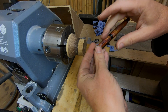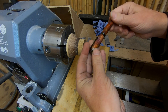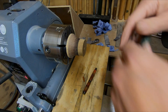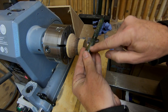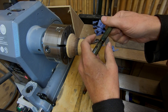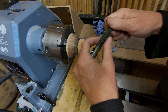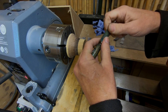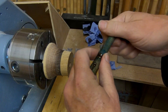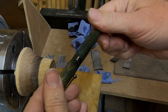Sometimes with these, the thread starts off in two different locations. So if you find your grain isn't lined up — and it's harder on this one — I'll show on the other pen I made where it's a lot more obvious. You can see: if you unwind this and let it click once, push the pen together gently — it's clicked once. If I wind it up again that grain is no longer lined up. Undo it, click it once, and there you go — the grain is all lined up again.